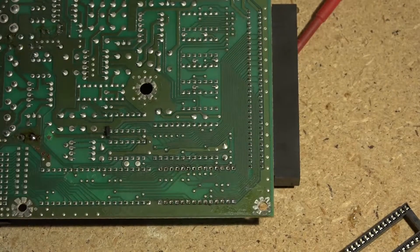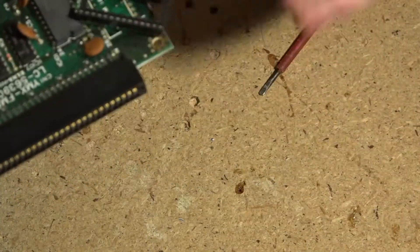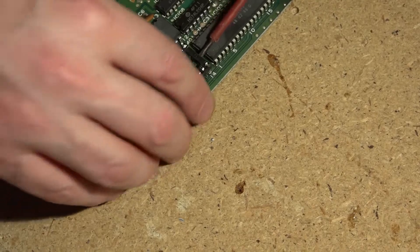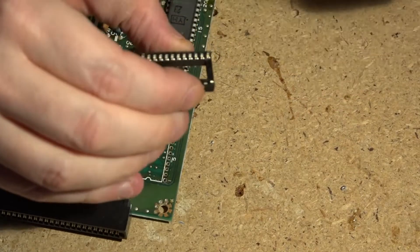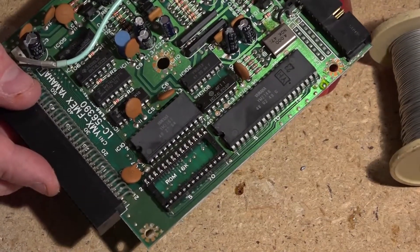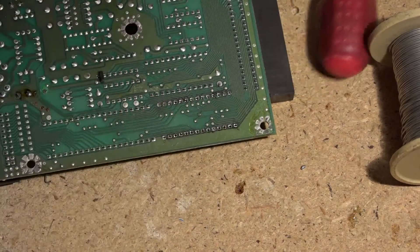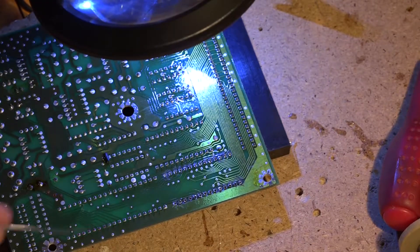So I have just looked at this with a magnifying glass and it appears to be okay. So the next thing to do is to sit the socket onto the board. I'm going to put the socket in place first. And guess what, two of them still don't want to go in. Third time lucky. Let's make sure these pins are back in their little slots. Eventually I have got the socket in place so I'm just going to solder it in now. It seems to be fairly solid.